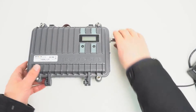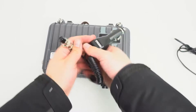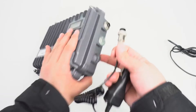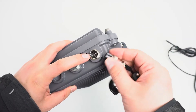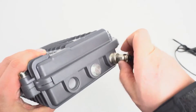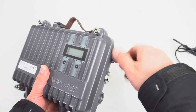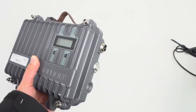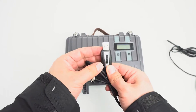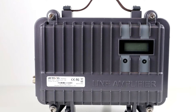In a way, this puts the RT-97 in competition with conventional transceivers with cross-band repeat. For example, you could set up a mobile radio on cross-band repeat, and since many mobile radios can have power output as high as 50 watts, they could easily outdo the RT-97 as a repeater, which can only offer 10 watts as output power. However, it's not always desirable to run a mobile radio at full power for extended periods of time, and it might be desirable to use a true repeater rather than cross-band repeat, so the Retevis RT-97 gets its moment to shine.